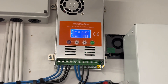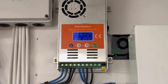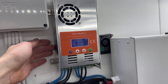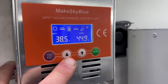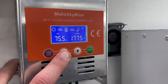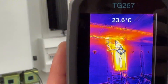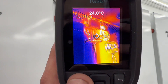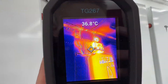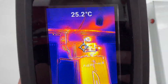It's reading 60 amps here and we hit 2.6 kilowatts at some points. My final verdict: for someone building a solar system, this is a very good MPPT solar charge controller. I wanted the cheapest unit and in my opinion this is excellent for the price. It doesn't have internet connectivity — there's a model that does — but it converts energy and works flawlessly. I'd definitely recommend it and buy it again. You can set the maximum voltage parameters and it will do its job, including very fast MPPT tracking when clouds pass over.